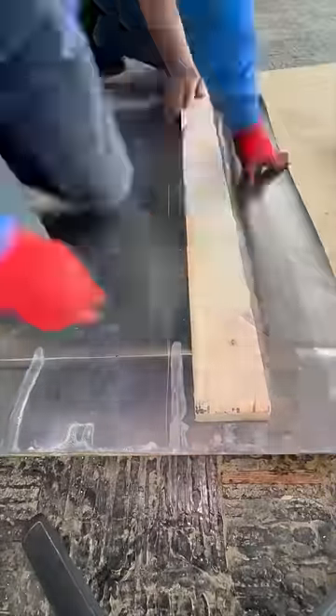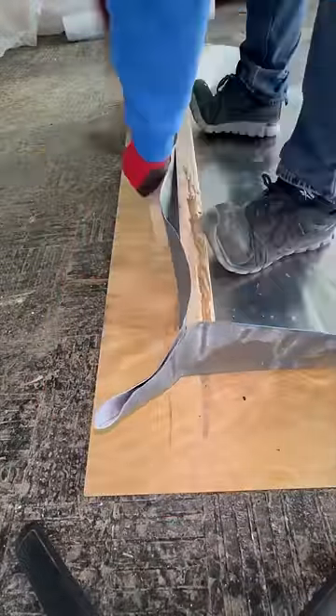After I get all measurements, I start marking them on the lead sheet a quarter of an inch shorter to account for the thickness of the lead. I usually raise all sides 6 inches, but with this one I only did 5 to avoid buying an extra foot of lead for $100 more and only using 2 inches of it.